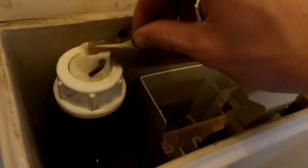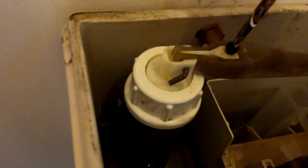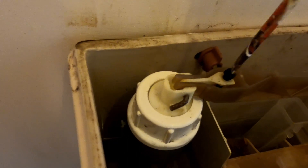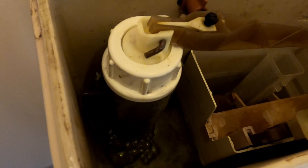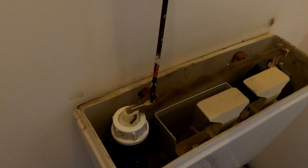So another little thing we need to look at now is how much that float is responsive to letting water in. As we can see it hasn't been able to fill up to this point yet, simply because it must have been much tighter to try and get that seal before. So this is the screw we want to change. What we're going to do here is just dial it back till we start to get that water flowing again. And you'll see as we push it down, we get that water flowing through there again. I'm just going to dial it until it stops.